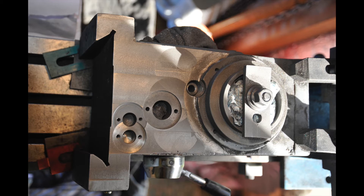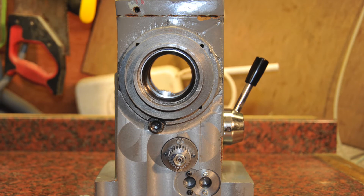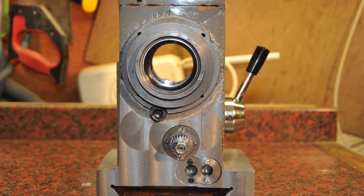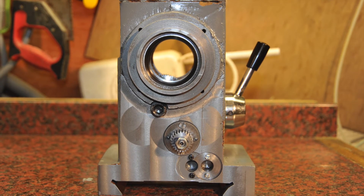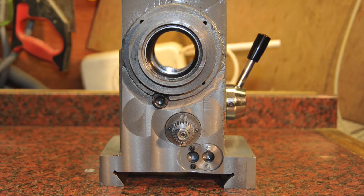I've milled a new location for the lower gear chain fixed stud. The flange slice is reduced to stay within the outer edge — there was enough meat to prevent perforating the casting. I can recover the old location if I need to, and I made a completely new stud as well, so we can revert back to factory.